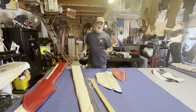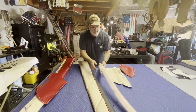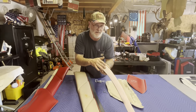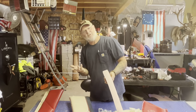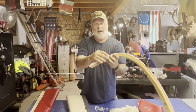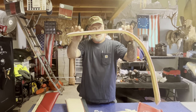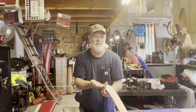It won't wear as bad if there's some foam there, and use scrim because it has this fabric backing on it. And in this application, you want that scrim up. I have had people say, well, what is it, scrim down, scrim up? It depends on what you're doing. The fabric up, because that gives it some muscle. That gives it some abrasion factor, okay? See what I mean? Other applications call for the scrim down always.